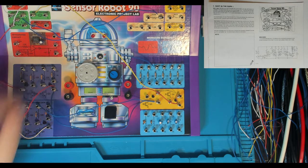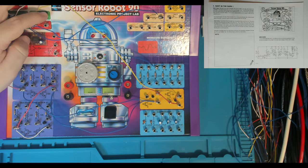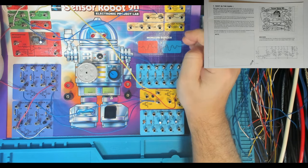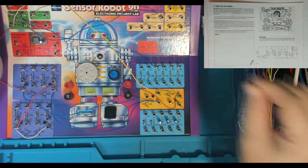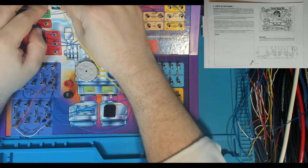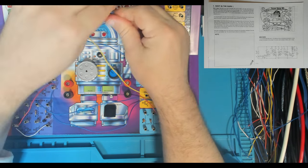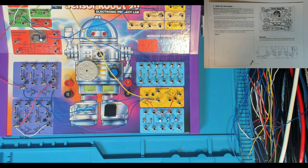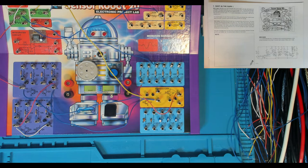And then we've got 9 to 18. 9 is the other side of our buzzer. It looks like the buzzer is going to get connected through the LEDs - which is pretty interesting. That means if there's a tone on the buzzer it's oscillating, but the LEDs will oscillate so fast that they'll seem to stay on. I think that's what the instructions were talking about when they said the buzzer sounds and the LEDs light - without this circuit the LEDs would light very rapidly and it would appear that they were on at the same time.